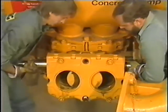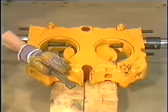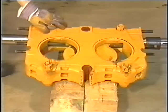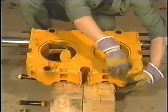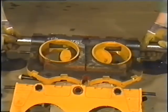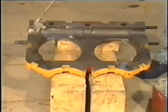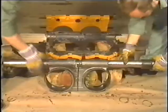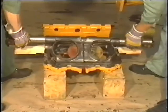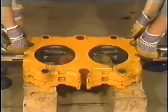At this stage, secure the gate valve package against possible tipping over with the help of a second person. For the further repair procedure, the following steps are to be carried out: remove casing nuts, lift off top half of casing, remove flat gate valve with shell and sleeves, grease sealing faces, grease new fittings, and place in one half of the casing. Put on the other half of the casing and screw together.